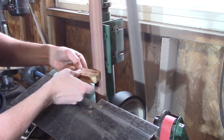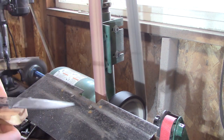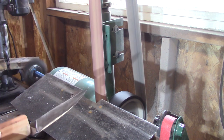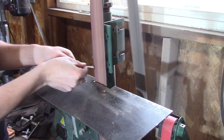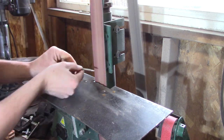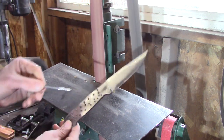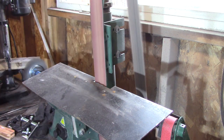I'm using the front part of the wood and just rounding it. I don't like it when a handle just cuts off all of a sudden, so I like the rounded look better. I use stainless steel pins — I taper them so they'll fit into the holes of the tang a lot easier.